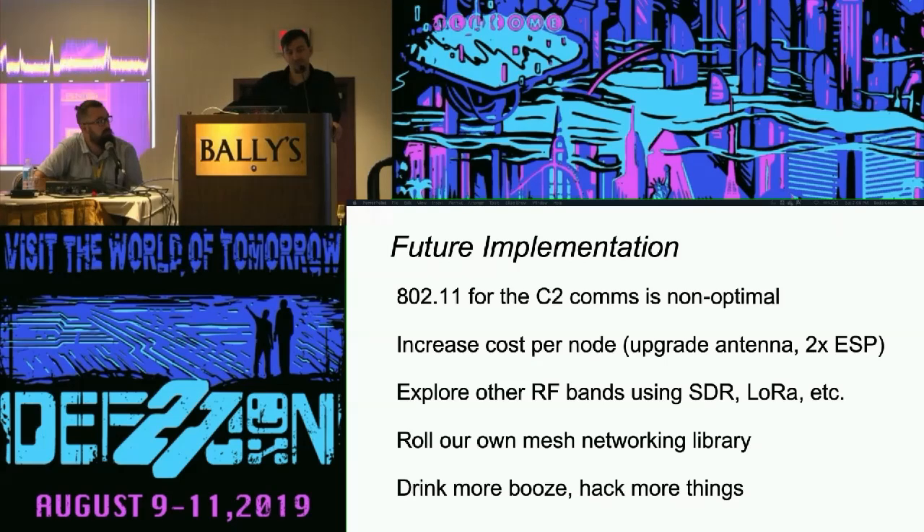We're thinking about switching to something more capable — if we could stomach more cost per node, we could build this into dual-band. LoRa would be great for backhaul communications, operating at a frequency less congested than 2.4 GHz. Obviously battery packs, better casings, and concealment options would all benefit from more investment. We wanted to keep costs low and be able to test, deploy, and interact quickly, but in the future we might seek out a dual-band chip. That starts at about $30, sometimes more — if you know of a $3 dual-band chip, please tell us.